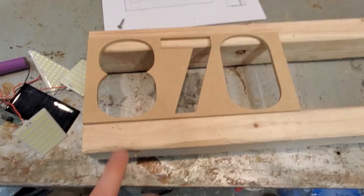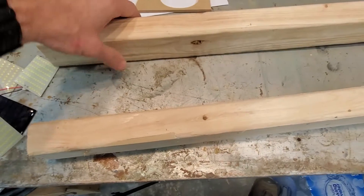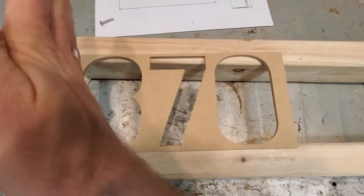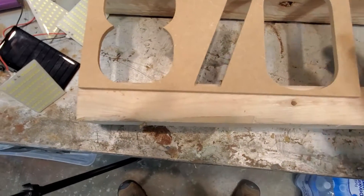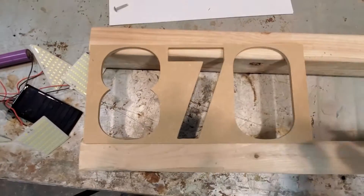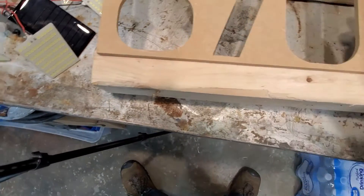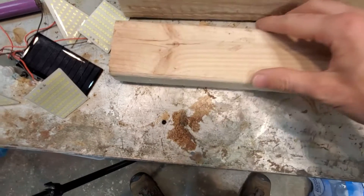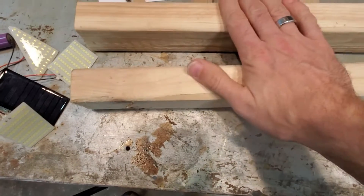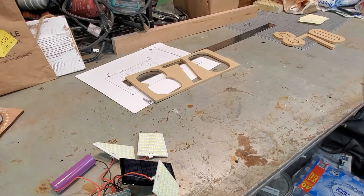After looking through my available materials, I've got this two-by material and I think I'm going to go full-on rustic - it's going to look natural and slightly unfinished. I'm going to do square box sides with these numbers and cut a groove both on the inside and the top where this piece will sit in that groove. I'm going to pull out my table saw; there's a routed curved edge at the moment that I'm going to flatten off so that instead of curved sides, we'll have flat ones.